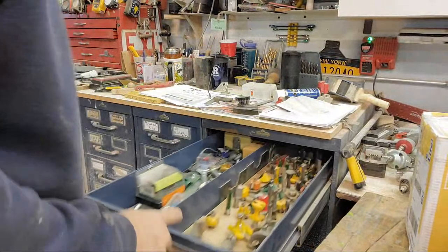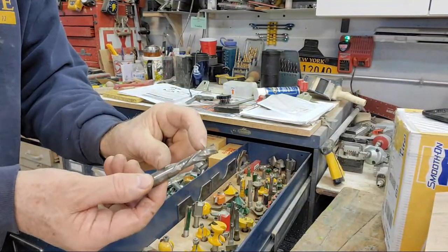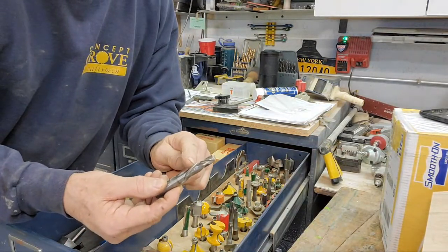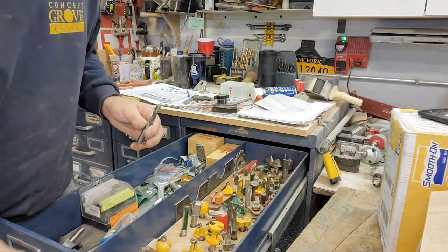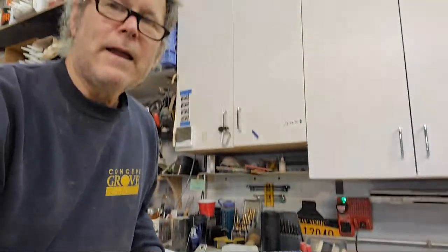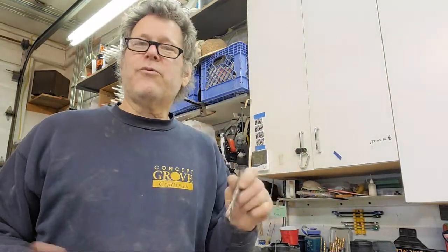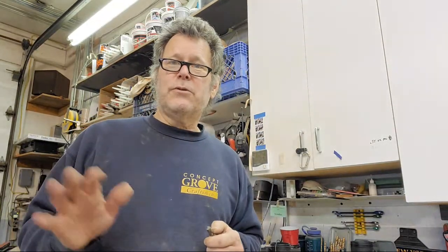Compression bits look like this — it's a spiral bit, but the top three-quarters spirals down. The OF 1400 is a really good all-around router — I don't want to dismiss it. But I'm doing a lot of heavy hardwood edging, routing two inches of material, and I want a lot of power. When I do template work I'm plunging through three-quarter inch or one-inch MDF making a full cut on both sides in one pass, so I want the OF 2200 for that. But the OF 1400 is a nice one. Sharp bits really matter — don't get fooled by horsepower and the size of the router.